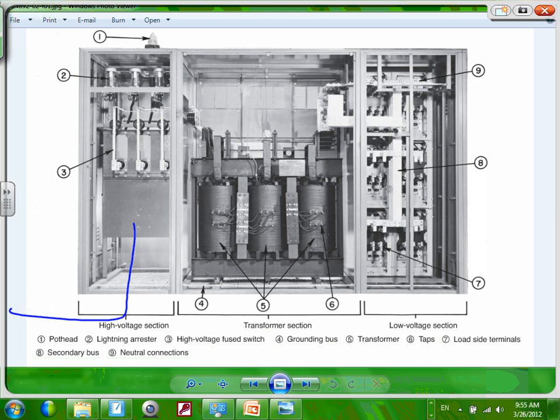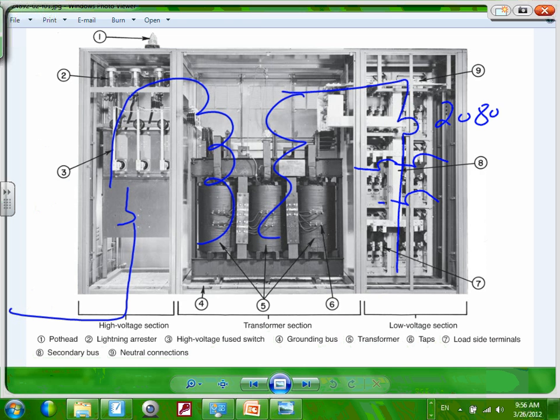Take this. I bring a transformer here. Here's my transformer. Out of the transformer here to the panel. Here's another application. This is 208/120. This side is actually 480 volt. This is another low voltage substation, right? You have a 480 on this side, just one transformer, and a 208 on the other side. That doesn't have high voltage, as in like 13.8.